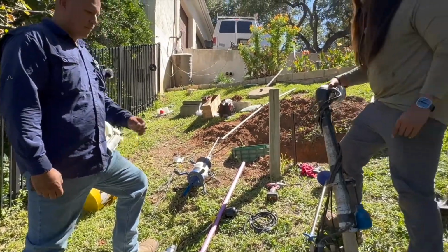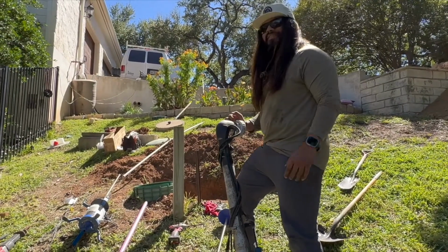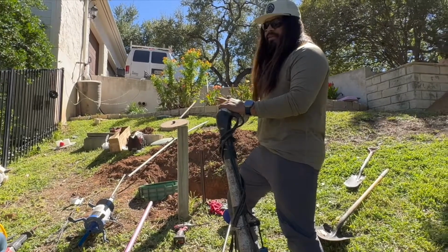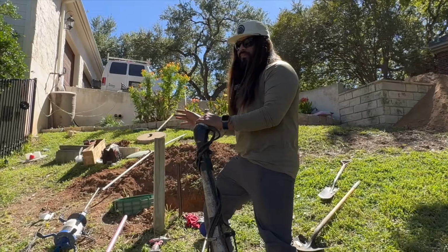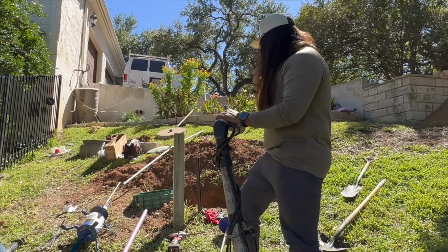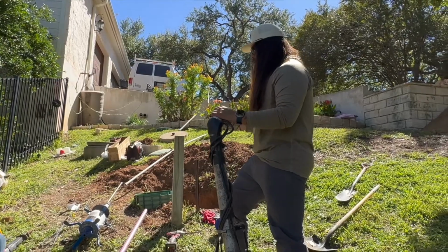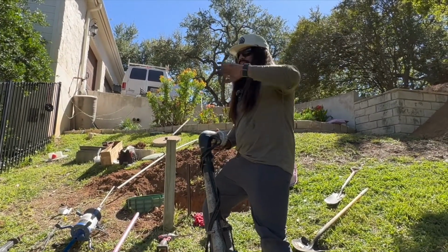There you have it from the man himself. And I'm telling you, I've seen some of these. A lot of times, if you have an LPD, people will bury all the chambers. But when you have an aerobic system, you're pretty much forced, in the state of Texas, to have quarterly inspections to make sure that everything's working properly. Because if it's not, say you have a spray system, you're spraying raw sewage, and your neighbors are not going to like that.